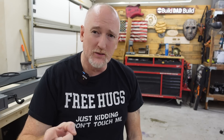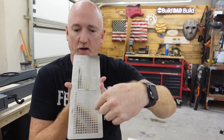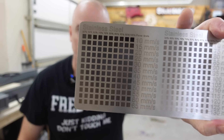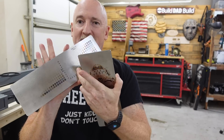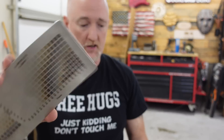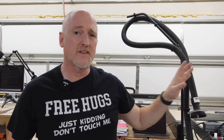I know you guys are going to want to know, does it do stainless steel? And the answer is yes. Here's the weird thing — this is from the X-Tool D1 Pro; you see those colors? This is from the P20 Plus. These speeds and powers are the same as this area right here, the colored area. And if you'll notice, almost all of those are dark — so it didn't really anodize, but it definitely marked. So I went ahead and ran some higher speeds, and it will mark at a higher speed where the X-Tool fades out. But you lose the color — you're not getting those cool blues; it's just black. So I almost have to give the W to the P20 Plus because it will mark at higher speeds.